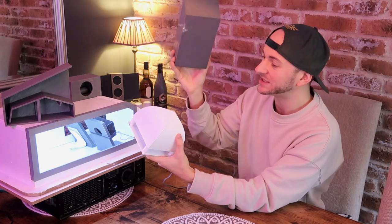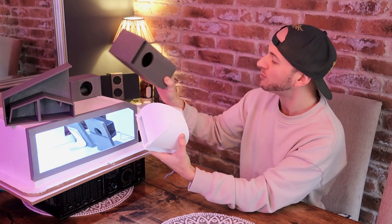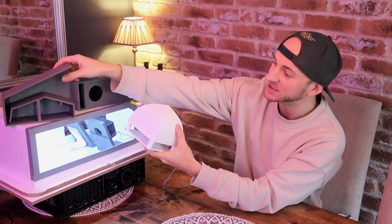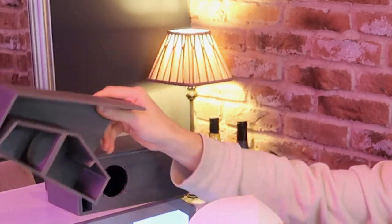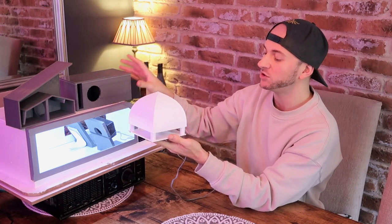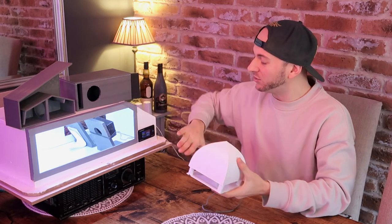Although Derek's V5 box has quite a large area of ports, meaning the actual chamber itself isn't super massive inside, even though it looks humongous. And obviously the half wicked one is large because we've got this massive horn section on the front. So yeah, it's quite a big volume for this driver, possibly the biggest volume that we've had so far. And given that we don't know what this is tuned to, we might run into some unloading issues. So I might not make it all the way up to the 15 watts on the watt meter when we do the DB testing.